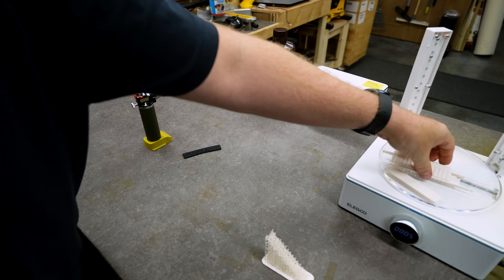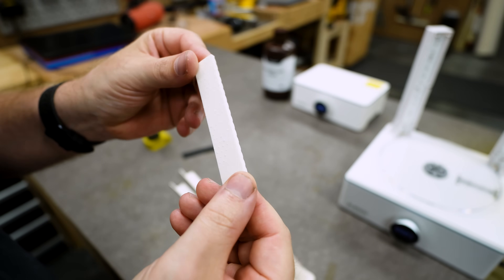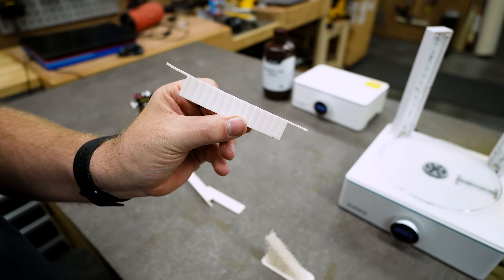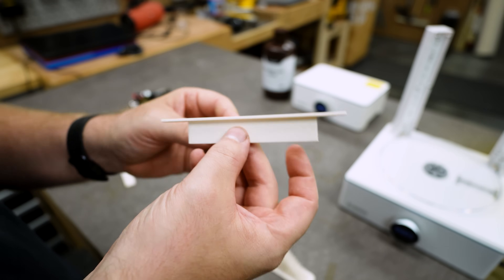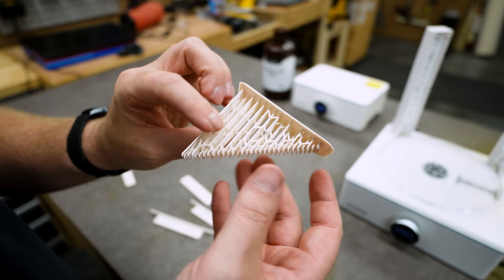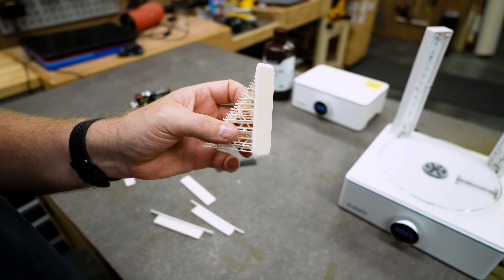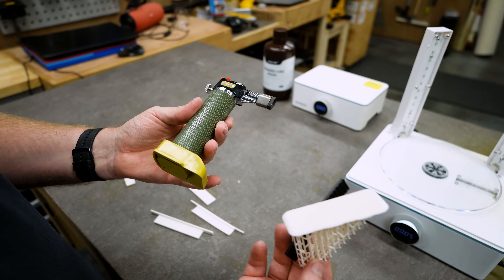It has been over a year since I turned this printer on. Here are our final parts that we are going to use in the new heater system. We have a little bit of yellowing, but it is pretty straight. One part is a little warped — I think it was under-supported, because the other one that was supported properly printed perfectly. We over-cured the support just to see how yellow it would get, and it is getting pretty yellow. Now they are claiming this material is resistant up to 200 degrees Celsius.